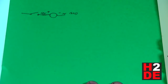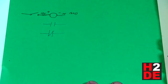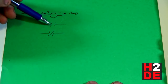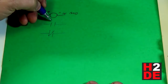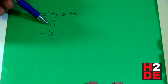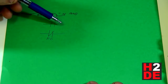You'll also have what they call contacts. There are two different types: normally open and normally closed. A normally open contact set will not be connected in its normal state — meaning there are no forces being applied to the relay. So in its normal state that circuit will be open, or disconnected.